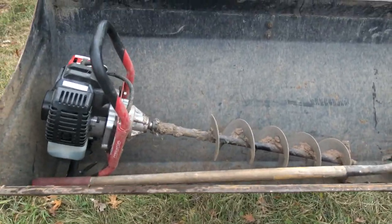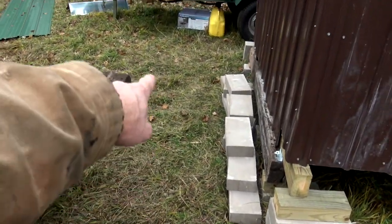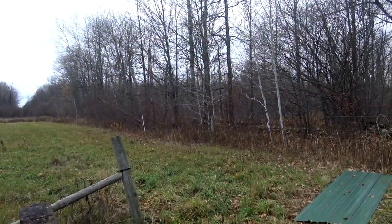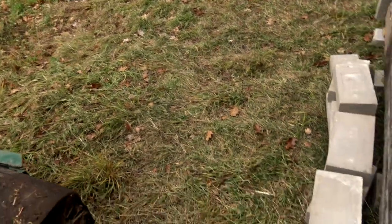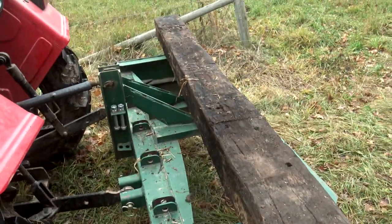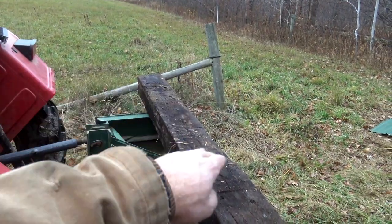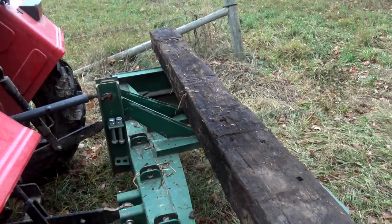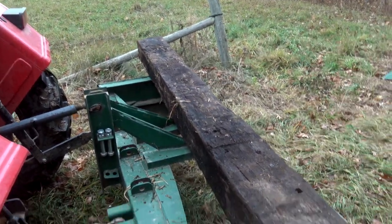Today we've got a little bit of hole drilling action going on out here. I'm working on building this off-grid solar-powered cabin. I decided I want the solar panels in this general area. At first I was going to mount them on a woodshed, but because of the row of trees the sun conditions require a certain angle, so instead I'm just going to drill a hole, drop a railroad tie in it, buy some two-by-fours, and build a grid to put the solar panels on angled the right way. A railroad tie is a little overkill, but it's here, it's paid for, and it'll work.